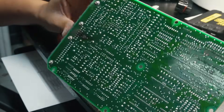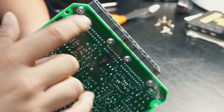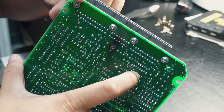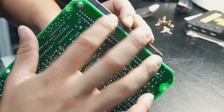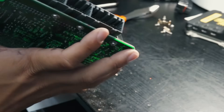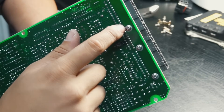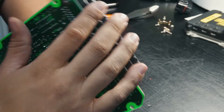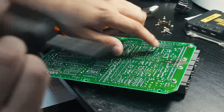This is actually attempt number two - I'm figuring this out on the fly. I've taken the board out of an OBD1 ECU. If you look underneath, there are four screws connecting the OBD harness to the board. On some units the screws have solder over the top - you'll need to desolder those. You can buy a solder sucker cheaply, or just purchase the headers separately for $25.